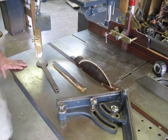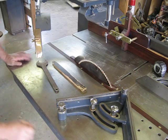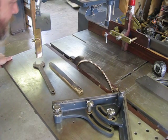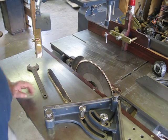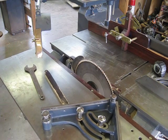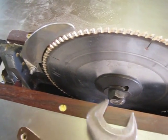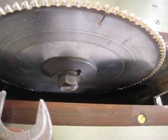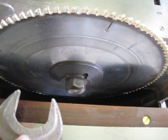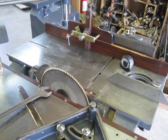I'd really like to emphasize that by pushing — you can see that the arbor is pretty massive. Here's the wrench. It's a stub arbor and it's a pin drive. So I'm going to show you changing the blade on the PK.